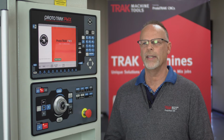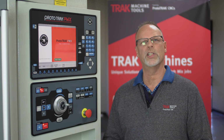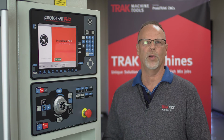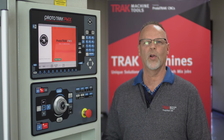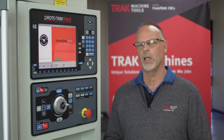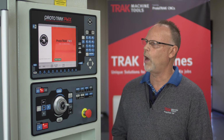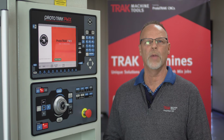So what I did originally is I had two different programs, one for each vise, and then I put the two together in what we call a master program. And once I have a master program, it'll run both operations at the same time. And so to get started, I'm going to give you an idea on how the checklist works and what you would do. So right now I'm looking at the screen and there's nothing in the memory.